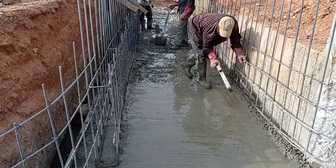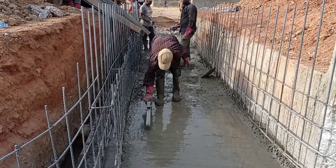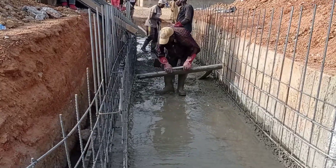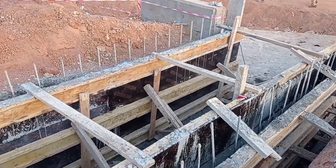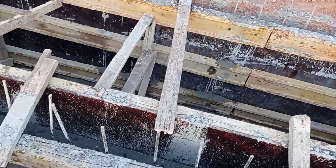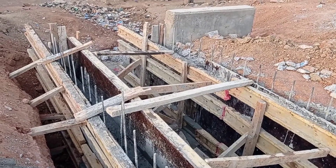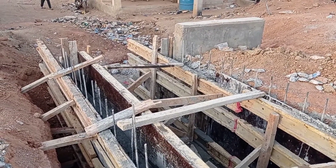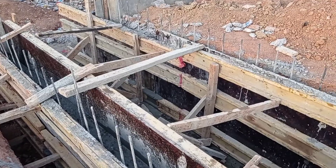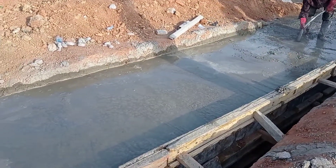The thickness of our walls is going to be 25 centimeters or 250 millimeters, while the end-to-end width is going to be 1.2 meters. You can see that we have put the formwork for the construction of walls. The height of our box culvert was maintained at 0.8 meters.